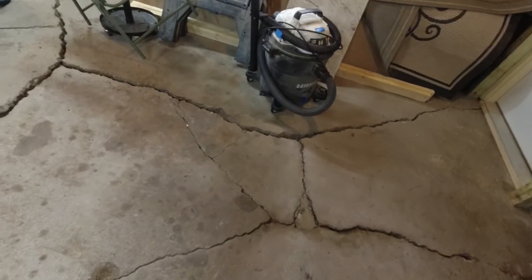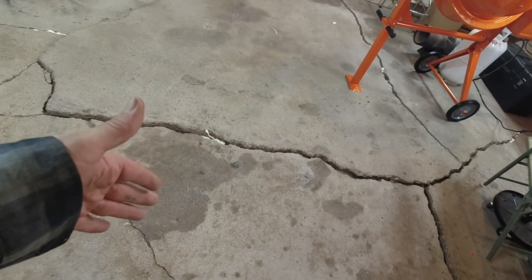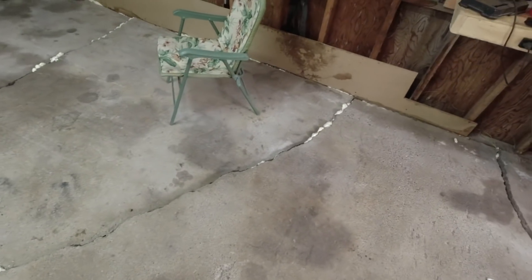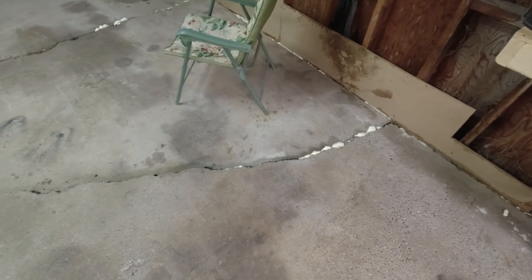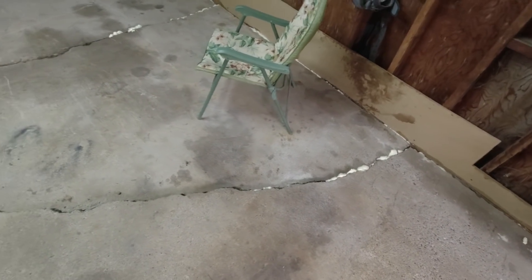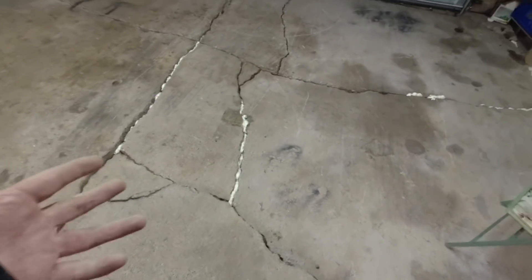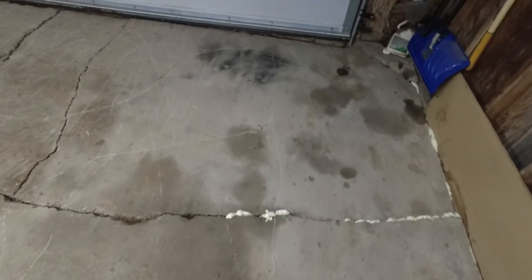Guys, we've gotten all the cracks cleaned up, everything's clean out of them. And wherever there is a spot where it goes way down — where the concrete will flow down and just go underneath this concrete floor — I have a spray. This was a recommendation of my brother, because he said it would just be a waste; it'll just run down underneath the slab. So he said to spray some foam. Either foam or backer rod — I think the foam would be easier. So I went along and put spray foam in. Now we just got to let this cure. It'll expand and we'll take a razor blade and shave it off even with the floor so it's not sticking above, and then we just start mixing and dumping.